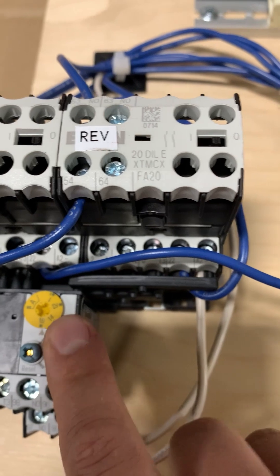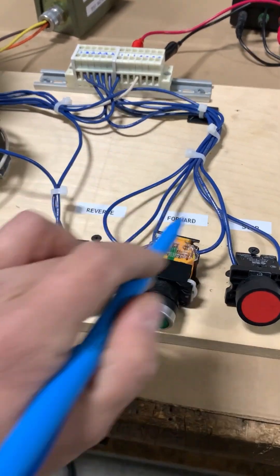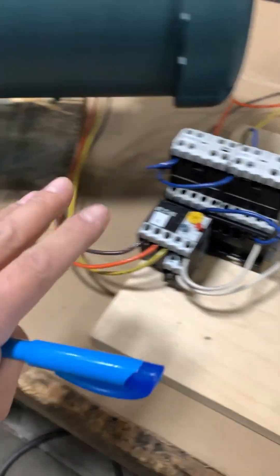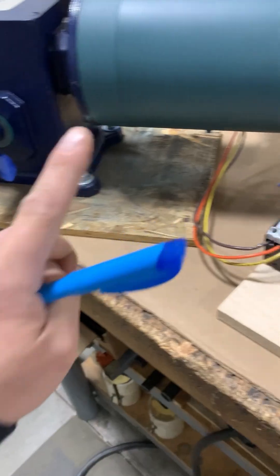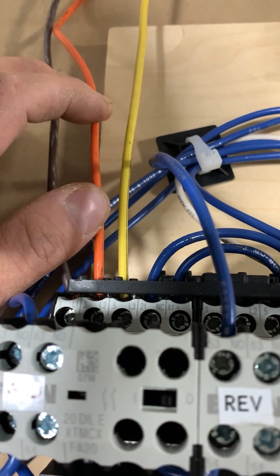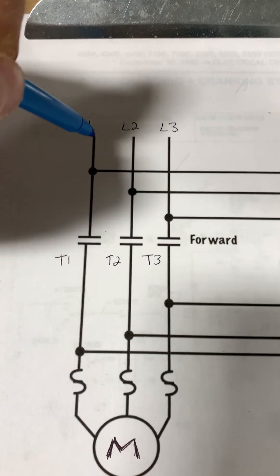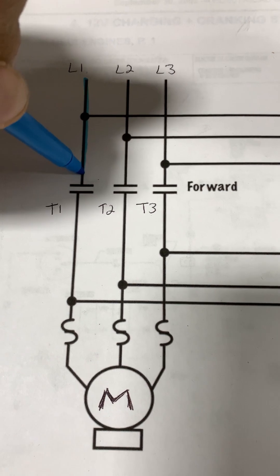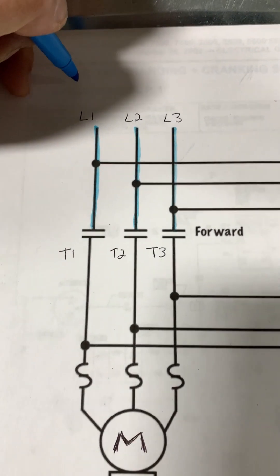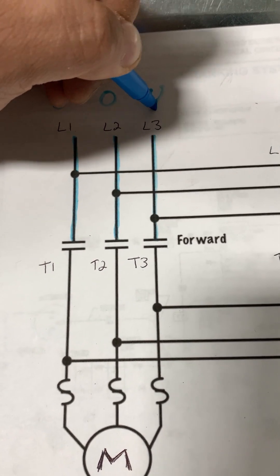We test our overload. This is the final part to this three-part series — we've finished wiring up our control and have wired in our power circuit. We have incoming three-phase power: brown wire to L1, orange to L2, and yellow wire to L3. These wires are terminated with brown to L1, orange to L2, and yellow to L3.